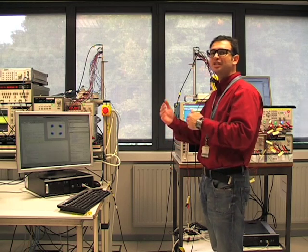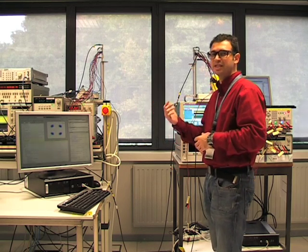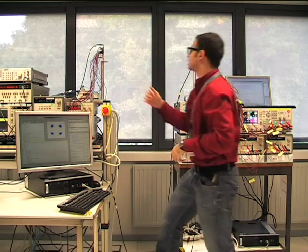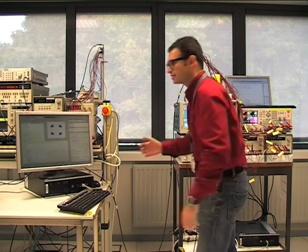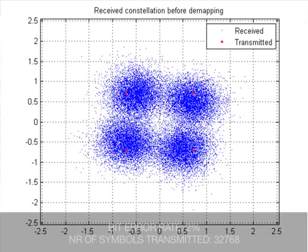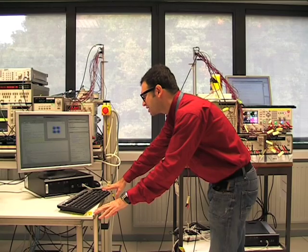Now I am going to disalign the chips. In particular, I am going to rotate the receiver. Now the receiver is not aligned anymore with the transmitter. I am going to repeat our test. Here we can see a degradation of QPSK, and the bit error rate is now not zero anymore but 2%.